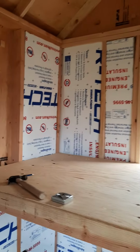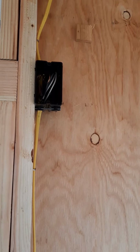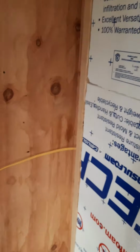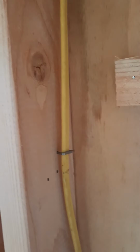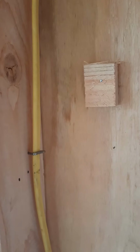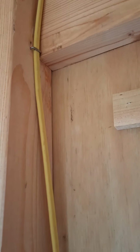And one of the challenging things, of course, is fitting the styrofoam or the rigid foam insulation around the outlet boxes for the electricity. Actually, that's not as hard as fitting it in around the wires, because my electrician did not put the wiring in far enough. I didn't tell him, he didn't ask. And my rigid foam insulation is 2 inches deep, and I actually moved this one over. So that's great, but in some other places I don't think I can move it over.